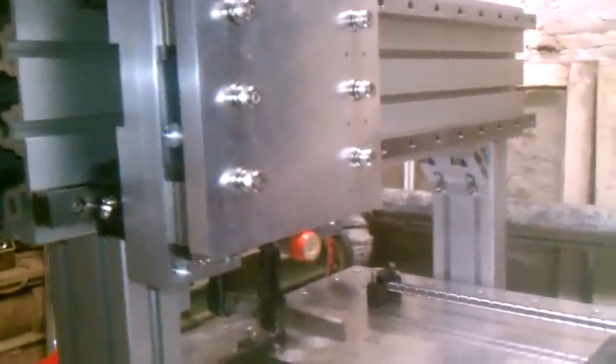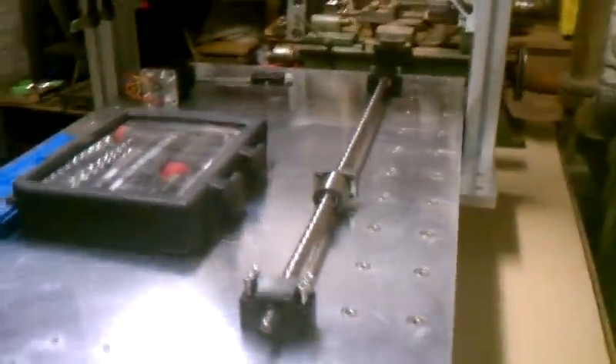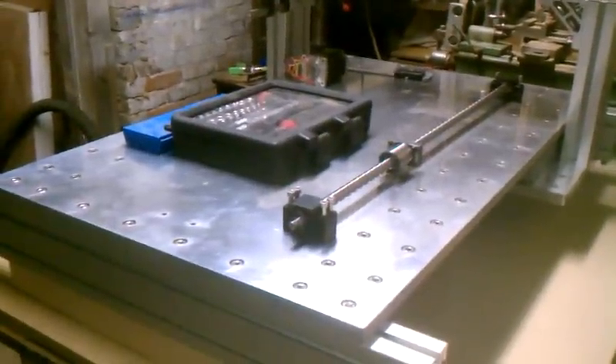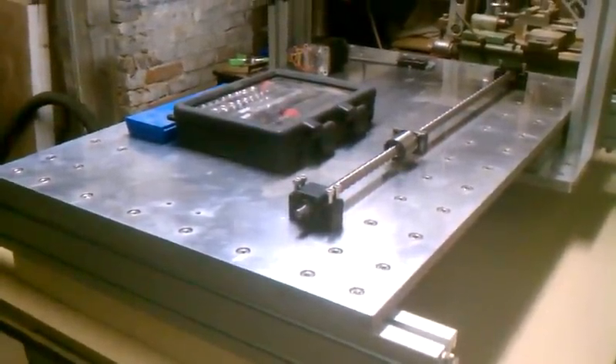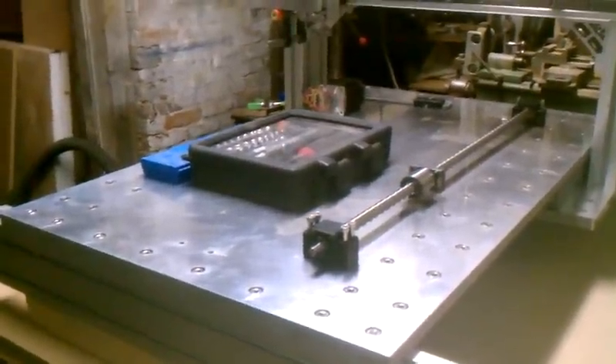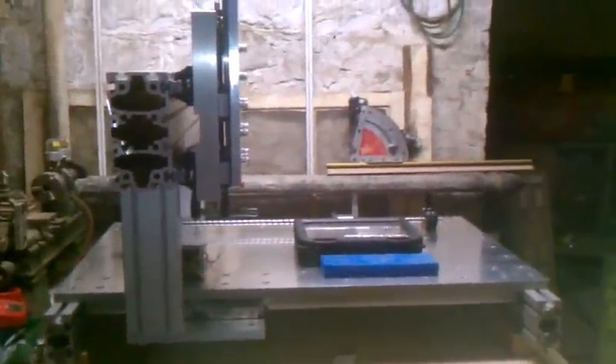For the carriage, I have it blocked so that it doesn't slide down. It is a rather heavy plate, but the movement is also very smooth and accurate. Anyway, I'm just going to back up so you can see a couple more views of this machine. Hopefully in the coming weeks I'll have the stepper plates made. I'm still deciding what I'm going to use in terms of timing belts and timing pulleys. And that's it — thanks for looking.